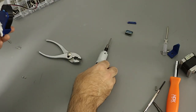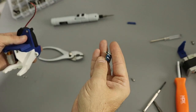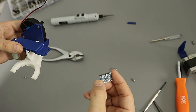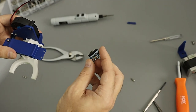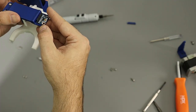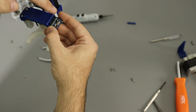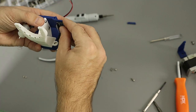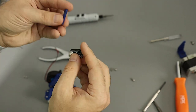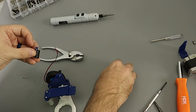The final thing you can attach is an ADXL345 accelerometer if you want to do automated resonance checking. By default it looks like it mounts one way, but given the shape of the carriage it can be difficult to plug into the pins, so I actually prefer to mount it upside down. Since there are solder joints on the bottom of the board, there's a little printed washer you can use to hold it off just a little bit.